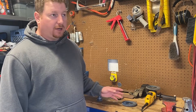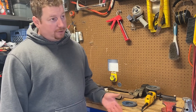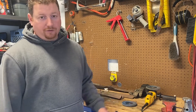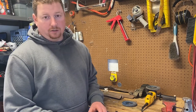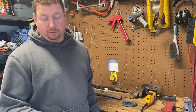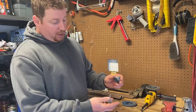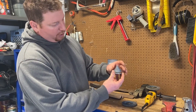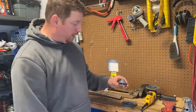One thing I've done — I've sharpened these in the past but I didn't have a blade balancer. It's important because if you don't balance, you're going to prematurely wear the bushings and bearings inside the mower. So it's a great idea to balance your blades. I bought one — it was a whopping 12 bucks. I'll put an affiliate link in the description. It's like a little thimble with a point and a graduated cone. You set the blade on there and balance it out with grinding.